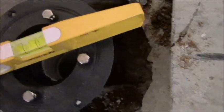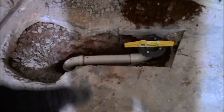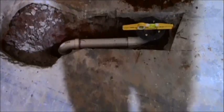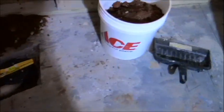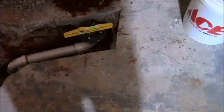And so I'm right on point with my line center with my drain here. It's off maybe half an inch. But anyway, yeah, do the fill back, fill in all that dirt area. I'm going to throw that shale, what I'm going to call shale now, back into that area, pack all that dirt down, pour a couple bags of concrete in there, level it off nice and even and all that stuff, and then it's a waiting game. And this is after the pour.